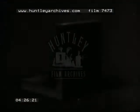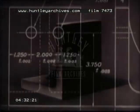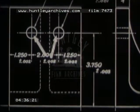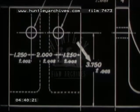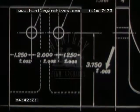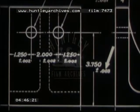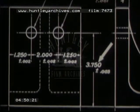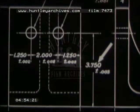A typical use for the vernier height gauge is in laying out accurately such parts as this fixture. The drawing of this fixture shows that 2 holes are called for and that the centers are to be 3.750 above the base, plus or minus 0.003. Even though 0.003 plus or minus is allowed, the height gauge should be set to the exact dimension given. Tolerances allow for minor inaccuracies in the tools used.